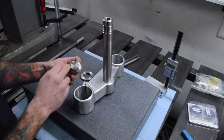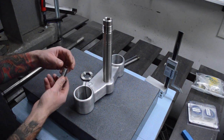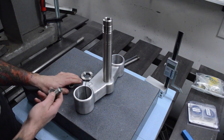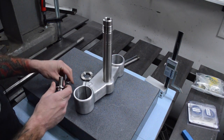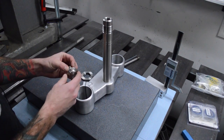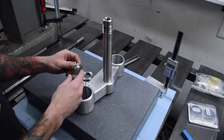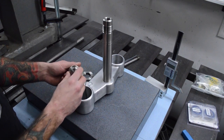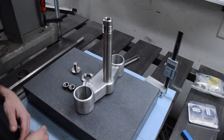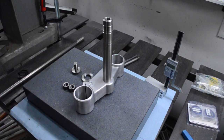So now we just have to put it in the mill. I think I'm going to use two regular 6-point nuts, these guys, tighten them on, and just back each one up against the other, put it in the mill so then we can index off those nuts, do the 6 cuts so we can have a bolt there. And then drill these holes. That's what we'll do right now. And these trees are complete. That's it.